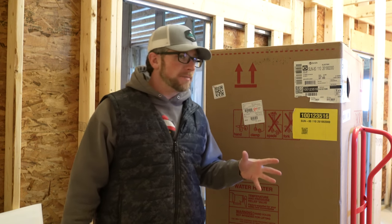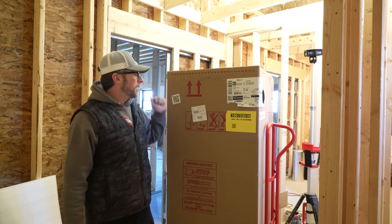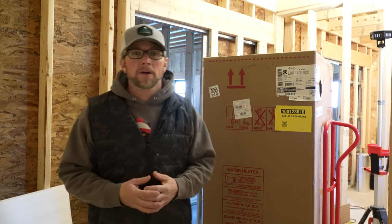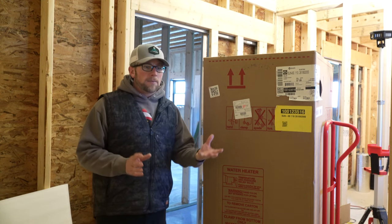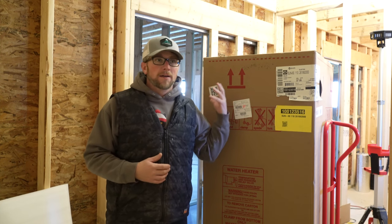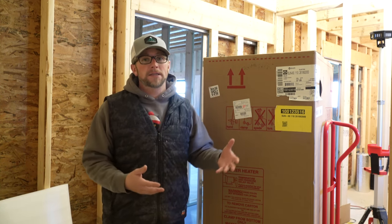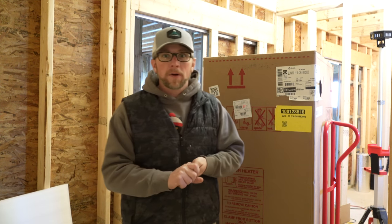There's gonna be a little bit of parts and pieces, I'm assuming, like connections we're gonna need to get that I didn't think of. But we got all the big stuff. We're hooking up an outdoor wood boiler made by Heatmaster, and everything from the wood boiler to inside is 1¼ inch PEX. Going around looking, I found it's very hard to get 1¼ inch PEX pieces, at least locally in our area. Lowe's, Home Depot don't stock them.